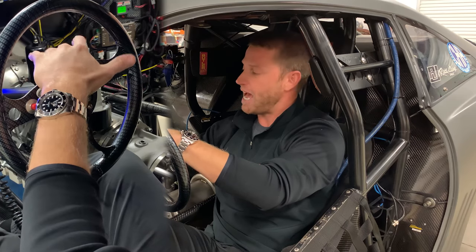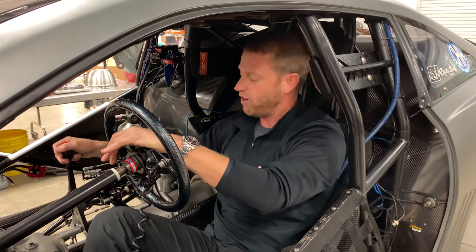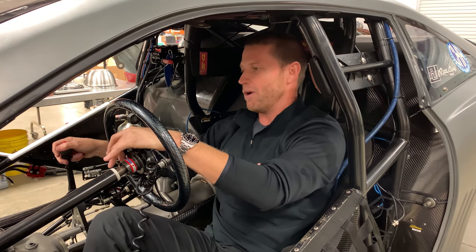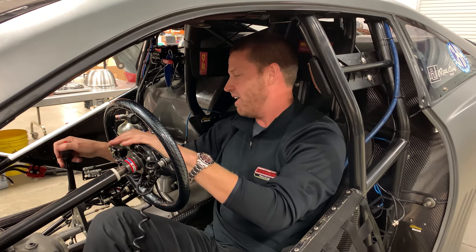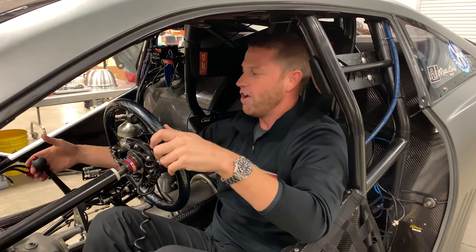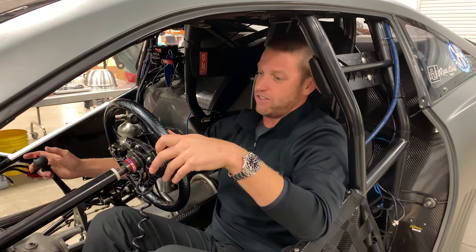I'm gonna give that thing a double tap. When I do that, I'm sliding the reverser, sliding the shift selector towards the forward position. I can feel the teeth in the reverser turning. When I give that thing a double tap, I'm not putting pressure on it to where it's grinding, but I've got just enough pressure on it where I can feel the transmission winding down. When that thing starts to wind down, I'll feel that sweet spot and boom, it'll fall right into gear. When it falls into gear, I'll reach up, I'll tap it backwards twice to make sure that it's in forward all the way, and then start rolling forward.